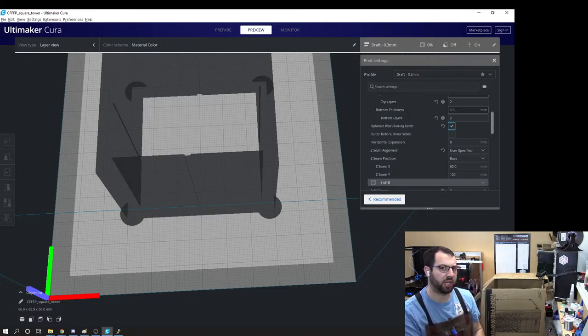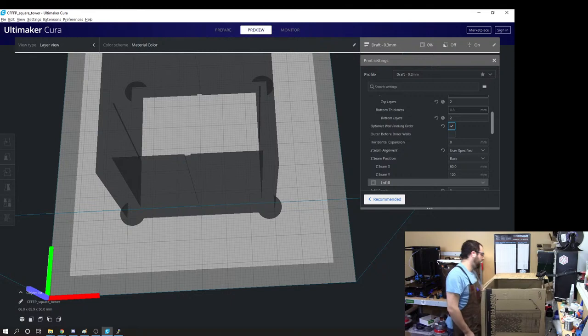Also, you need minimum layer time. You need time for the walls to set up. So if you're trying to print one object by itself, and this is why I have a million Benchies on hand. Okay, so